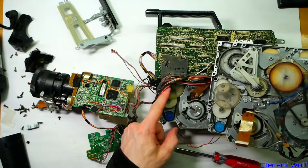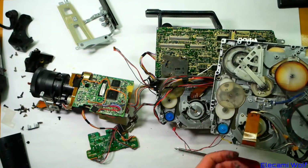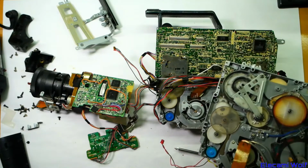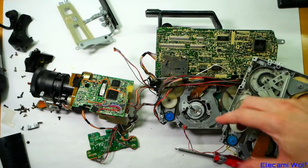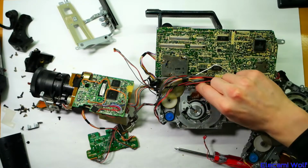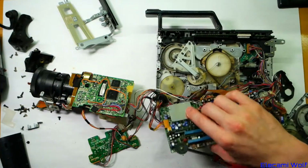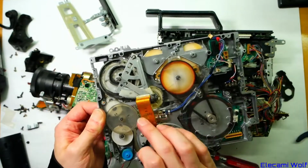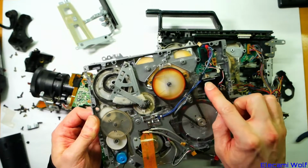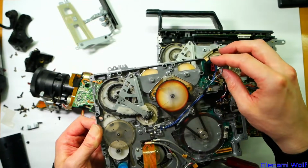It looks pretty much exactly the same. The bottom of the head drum there with the motor and the ribbon cable coming out of it. Although the ribbon cable is different. No, I think it's the same, it just has a curve in it there, whereas it's straight here. And then the signals coming off the head are on the shielded wire, which go up into there, which would be the head amplifier. The mode switch there, as the mechanism goes into different modes, that switch moves along to tell it what mode it is in or has reached.